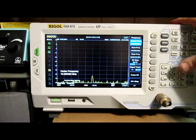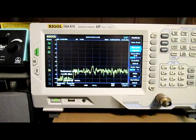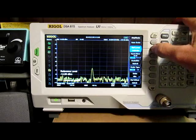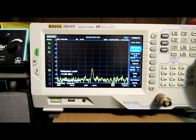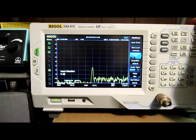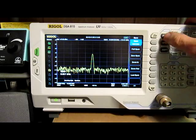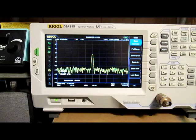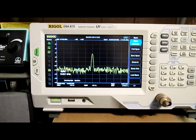I see something, it's kind of low actually — that's good. Let me raise the amplitude up a little. For something that's supposed to be accurate, it's only measuring at 10.004320 MHz at minus 116 dBm. I wonder if I take the x10 probe off I can survive this.